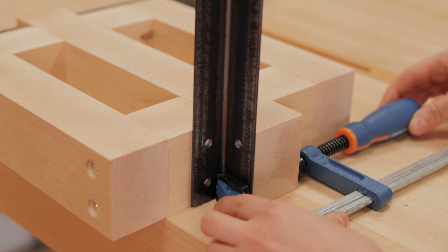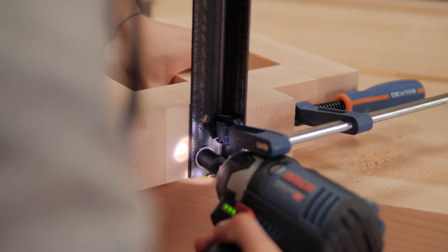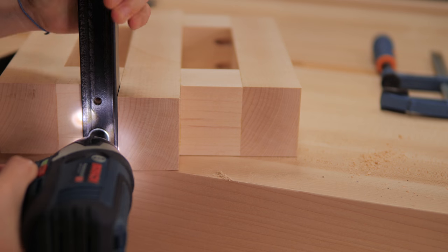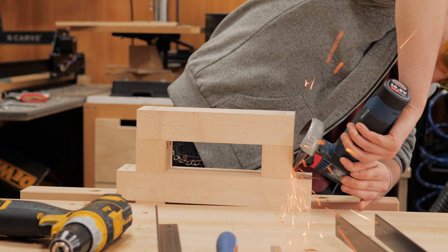I thought it was okay to make a thin pilot hole and drive these fat boys, but the wood split and I clearly needed to make rather large holes before driving the lag bolts. What the? I even broke it when unscrewing it. It's hard maple, right?